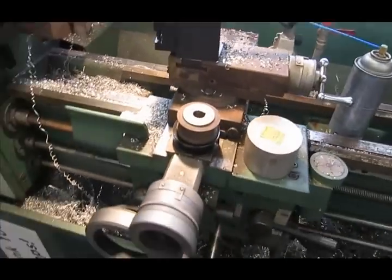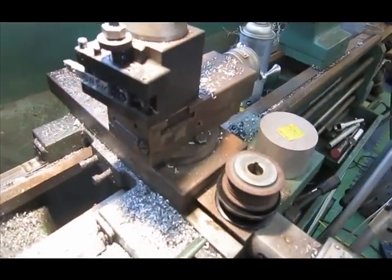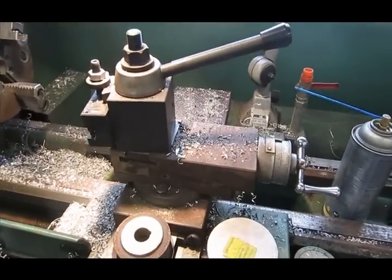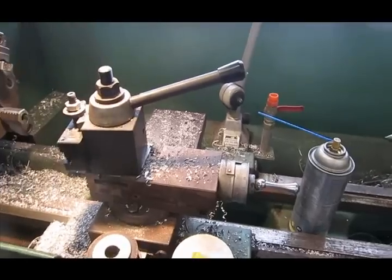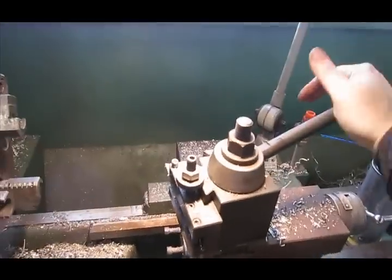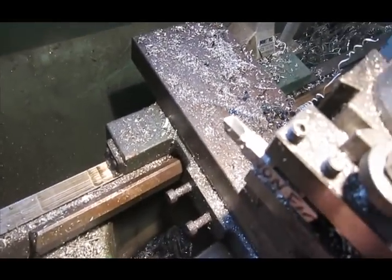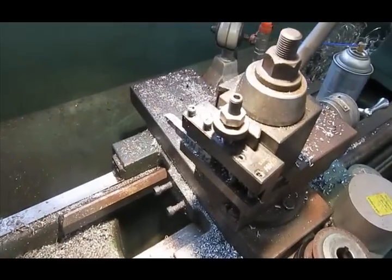This is the carriage — the part that moves back and forth. It has two main dials: one to move it in the long direction and one to move the top part in the crosswise direction. Then you have your compound slide, which is here. There are angle markings, and I can loosen it and tilt it at an angle — that's how you cut an angle on a lathe. I currently have it at zero degrees running parallel to the main slide. The tool holder here is a quick-change tool holder. What I have set in here is a left-hand turning bit for aluminum and non-ferrous metals — there's a carbide tip brazed onto a steel shank, a pretty common inexpensive type of carbide tool.